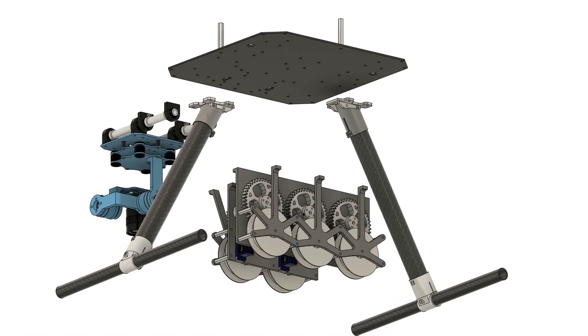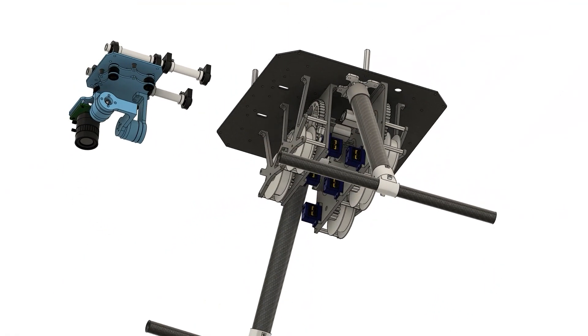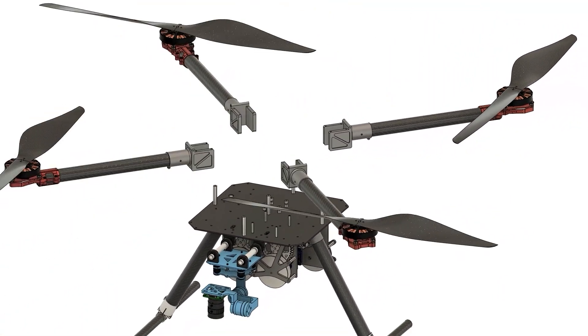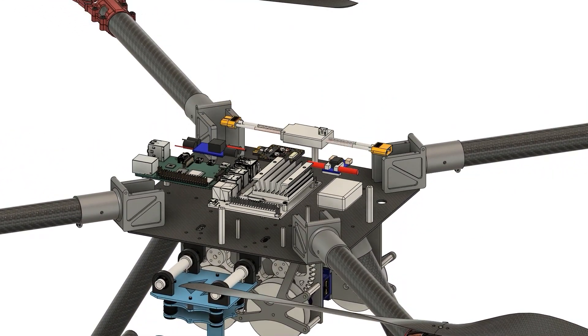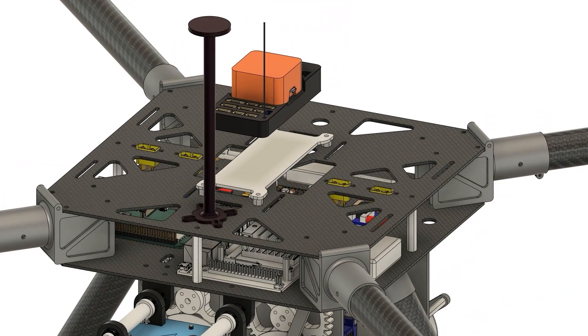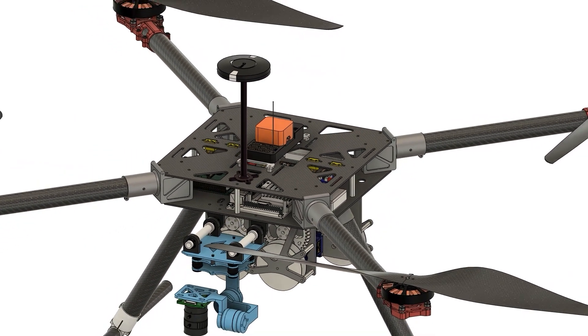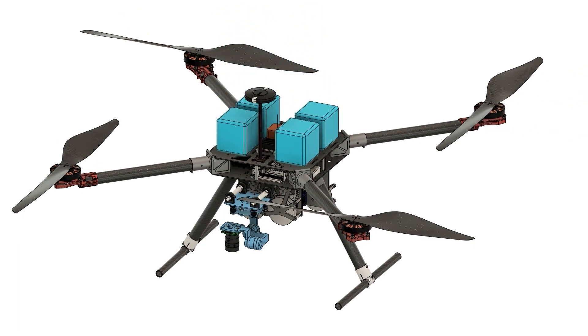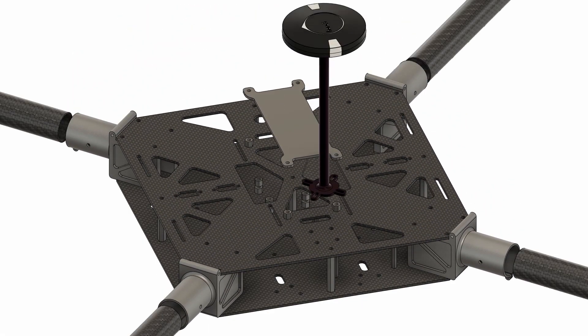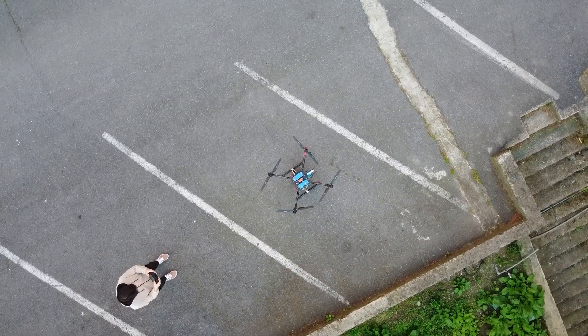To achieve optimum weight and durability, the UAV is designed as an X-shaped quadcopter consisting of four identical carbon fiber arms and a two-deck square mainframe. The plates are joined by metal folder arms, and spacers are added to provide rigidity. Motors are connected to the central frame from the corners with carbon fiber tubes at a dihedral angle of 5 degrees. Battery packages, GPS, and the flight controller are placed on the upper plate. To prevent interference with the GPS, other electronics and high-current cables are placed on the lower plate. The UAV is lightened by creating holes on the plates at low-stress locations.